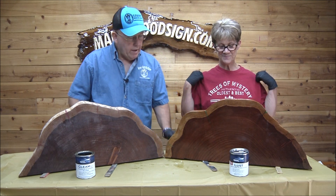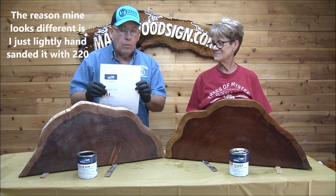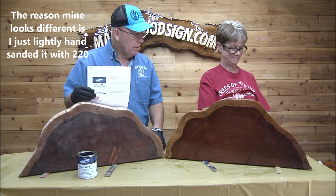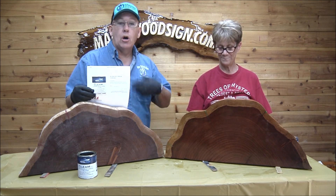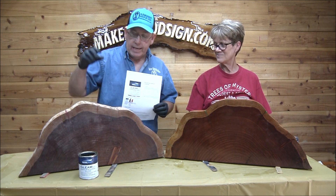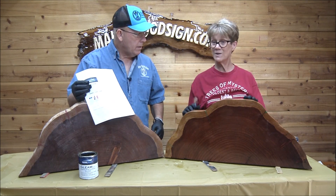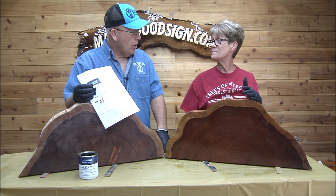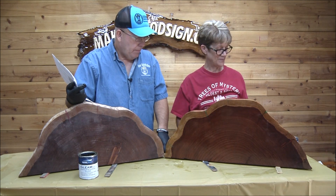We're back. We've both got two coats of the Gleam gloss. Vicki wants a matte or satin finish — she's using the Lust matte. We got a tip that said to put two coats of gloss underneath and then put the matte or satin on top. I'm going with all gloss, staying with the Gleam gloss. The difference is that mine doesn't need sanding between coats and can be re-coated after about an hour.